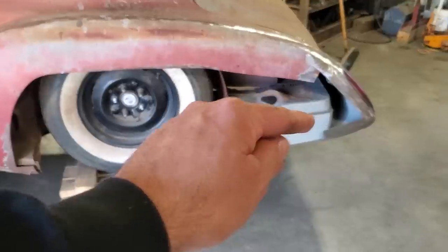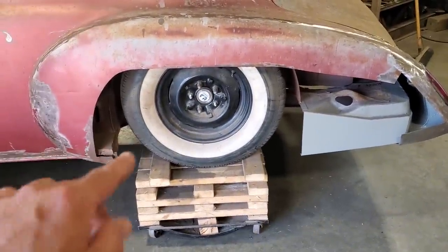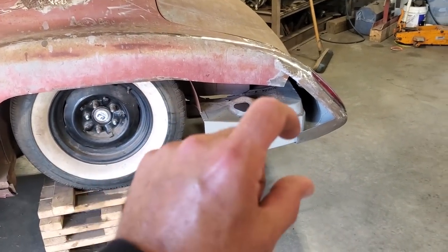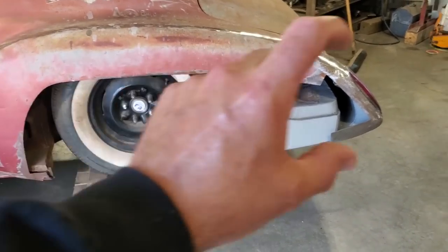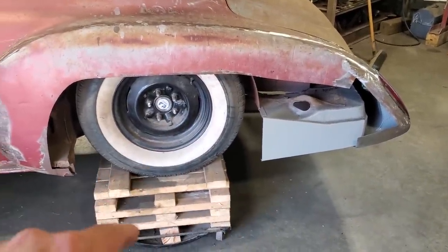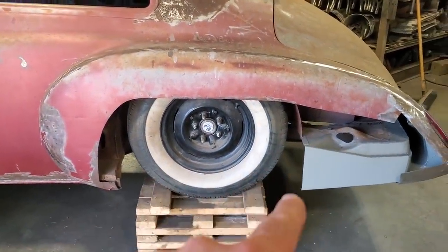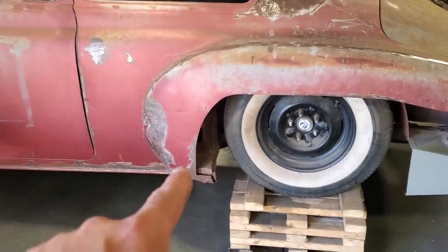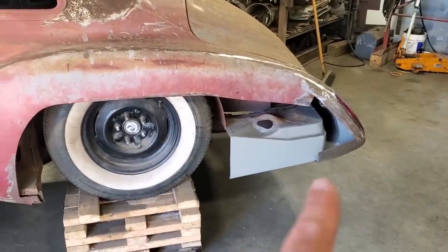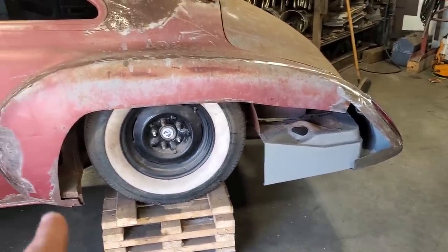And then I can actually start making the section from here back to here that rolls in underneath and welds on. I'll install that, and I'll do the same up here. It's very hard to make this upper section with this lower section, so I'm trying to simplify this and do it in sections. So I've got a piece here, and then I'll make a large section here that I'll cut out of, because I've got an idea that I want to do. I want to incorporate the same type of lip into the skirt on the back side of this, but it's going to be extremely low. I'll just put a bit of accent to it and it'll flow with this line that's on the car now. It'll come up, flow along here and go down. So first thing I'm going to do now is size up and put some tape on this to figure out what I'm up against, if this is low enough and if it's going to flow right.